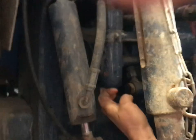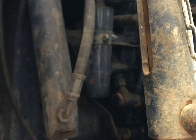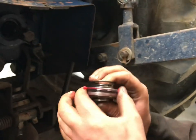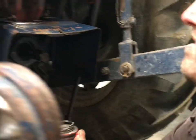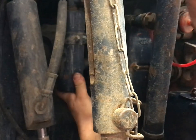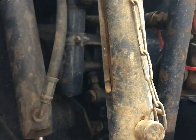I've already cleaned around this but we're just going to clean inside. There needs to be no rust or anything like that up inside because it can be a pain. The filter goes in. What I tend to do is smear a little bit of grease around this plug simply to stop it rusting in, because quite often these do rust in and they are a pain to get out. So we'll pop the filter up inside, pop that underneath and then this should simply push up and in. I'm just going to give it a tap with the handle.